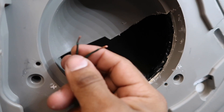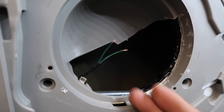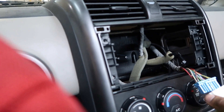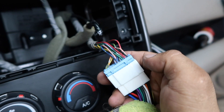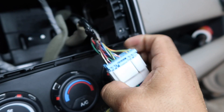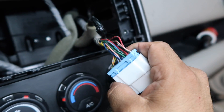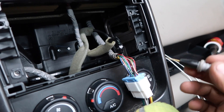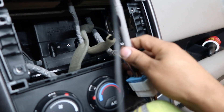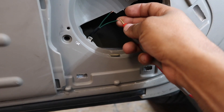The question is which terminal is positive and which is negative. Grab your plug — you can see on the back of the plug which one is positive. In this case, the green-black wire is positive and the green solid is negative. You can also use a multimeter: grab one lead, put it on one side, the other on the opposite side, and there you go.